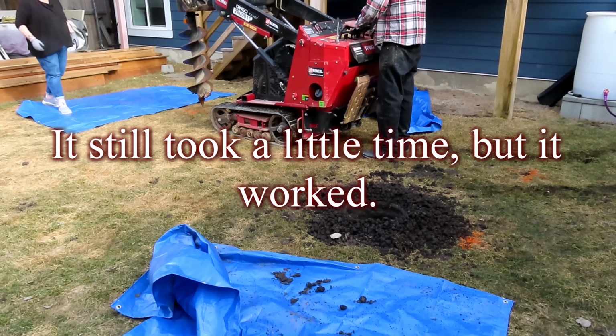Now to frame the new deck. I'll leave the old deck up as long as possible so that we will have stairs while constructing the new deck. I will also use the existing frame of the old deck to help align the new deck, and remove it from under the new deck after the new posts and beams are in. To start with, remove the end plate.